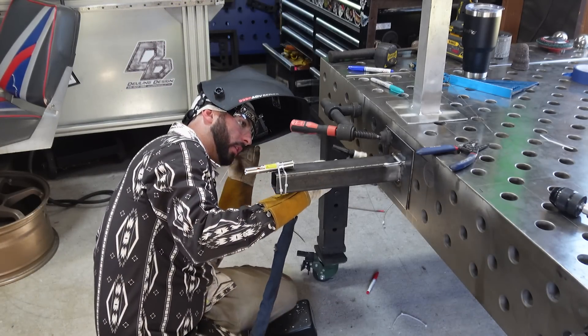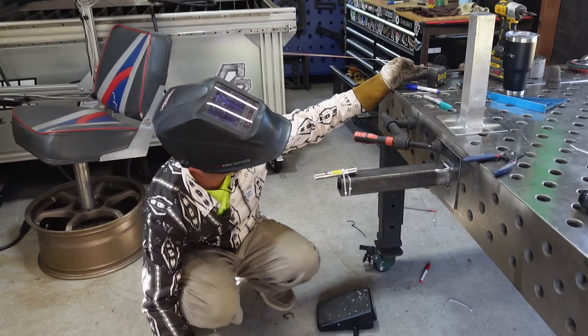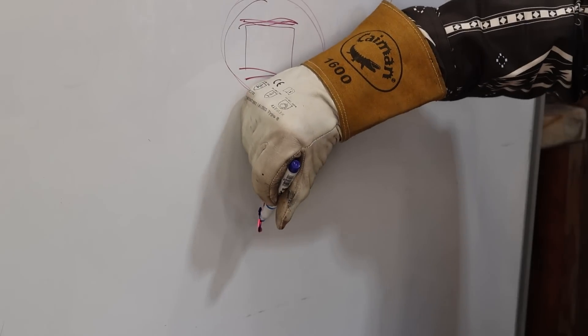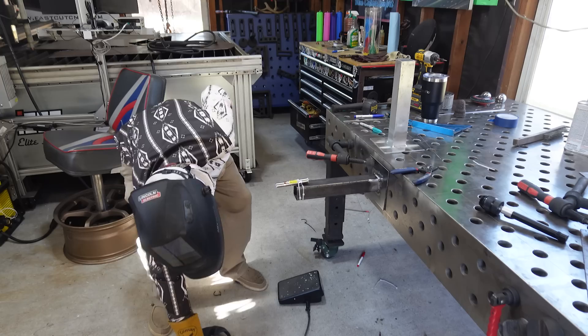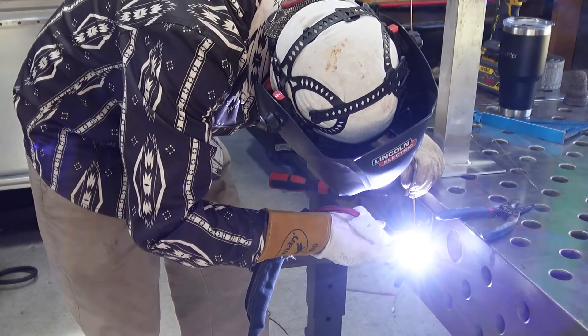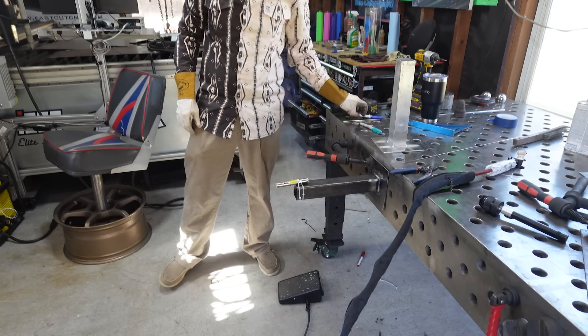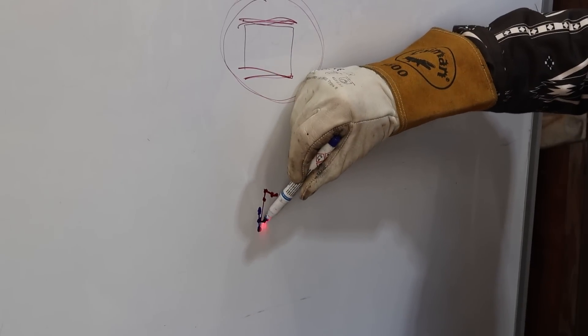Now we do the bottom. Not a whole lot of movement on the carbon either — we probably moved just a skosh. I don't even need to put a straight edge on it. Pretty much in the same spot. Pretty safe to say nothing's going to move a whole lot. Then it pulled down a lot — about halfway back to zero. Way different than the stainless steel. Minimal distortion going on with carbon steel compared to stainless.